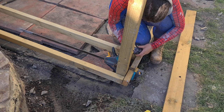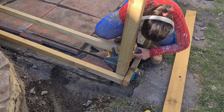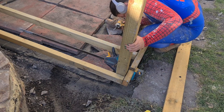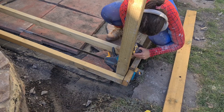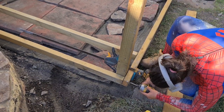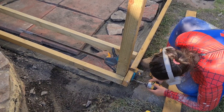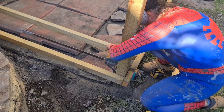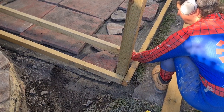I was feeling unhappy with how this beam was lying against the post — it just wasn't flush. This was that warped piece that I tried to straighten out before. Someone in a previous video recommended clamping these two pieces together rather than using screws to make them more secure. I could have clamped the piece of wood where the screws were and used a second clamp to tighten the pieces. Here I was just looking to make it more snug. I took out the original screws and put in some slightly more heavy-duty, longer screws that would go deeper into the adjoining wood. I'm unsure about my success — does it look like the wood is closer?